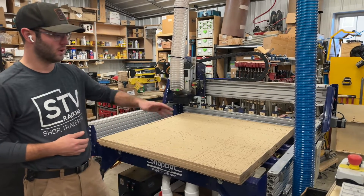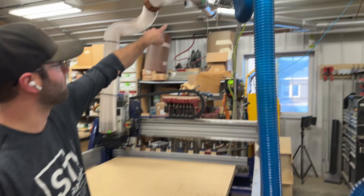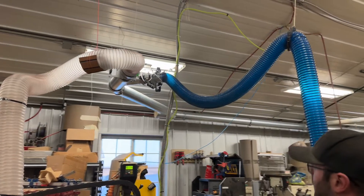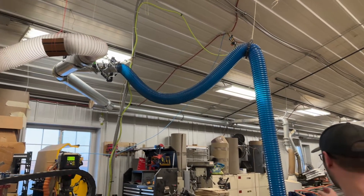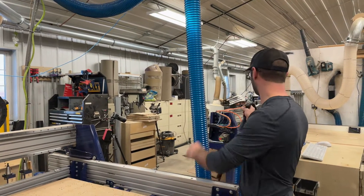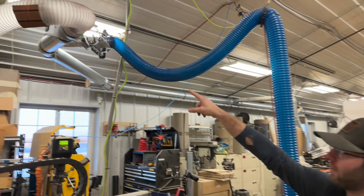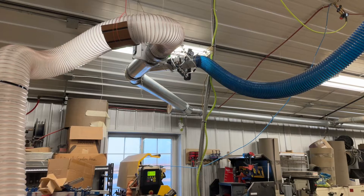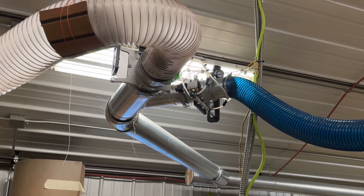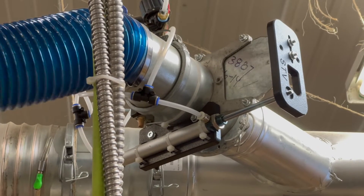As we continue to look here at the front, I've put in a dust collection system on top that feeds both a six-inch hose at the spindle as well as a four-inch cleanup hose that is a nice nifty little hand vacuum over here. What we've done is wired in two pneumatic cylinders — one to the six-inch blast gate and one to the four-inch blast gate — and that allows us to switch the blast gates very fast and efficiently just by a switch here on the front.